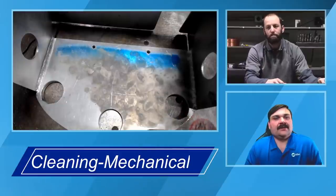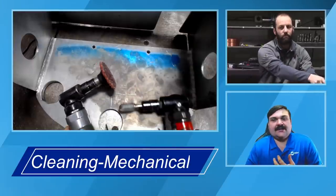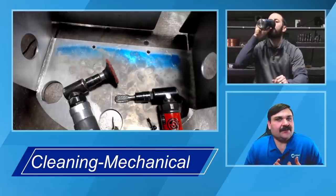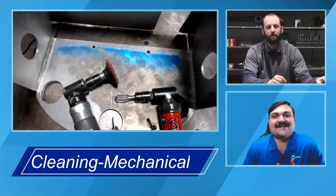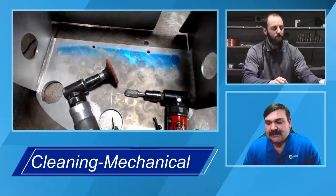Yeah. And another thing to keep in mind, like Andrew said, if we go back to the grinder, high speed with the brush is going to smear into the surface. Typically, a lot of grinders out there now are using flap wheels, which are by and large made out of aluminum oxide or some other kind of oxide like that, that we're going to end up driving into the surface of that plate.